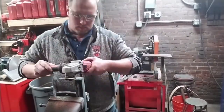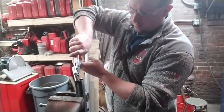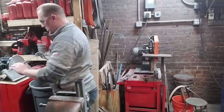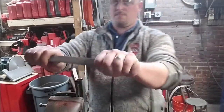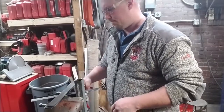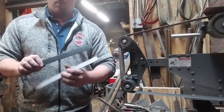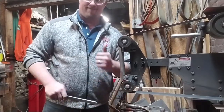And here we get to see the big reveal. The lighting is not great, but just the color difference alone — you can see there's been a significant change in the steel. And look how hard I'm pushing; I really cranked on that. As I pull these out, if you look at the bottom corner you'll see a little shadow of blue, and that is where the charcoal fell away from the upper corners of the piece. That was the mild steel. And here — look at that sparking difference. We've made steel.